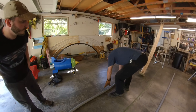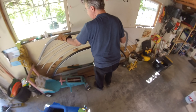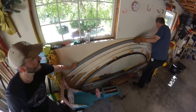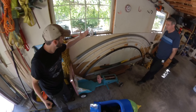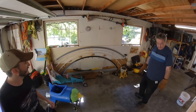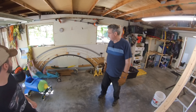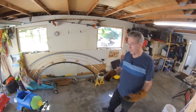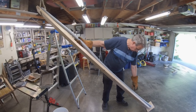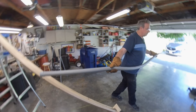So now before it gets too hot, I want to move it over. It's just getting hotter right now because that 400 degree sand is... And that's it — you just leave it there? Leave it there. In about a half hour I'll dump the sand, that warm sand, back into the pans. Two batches of sand, make about 15 in a day, depending on your heat up time. We could make any kind of tube out of this, or we could make a circle if we really wanted to, whether it would stay round or not.